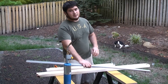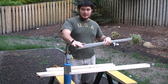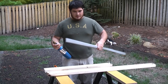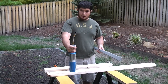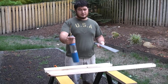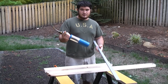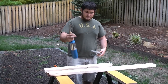Alright, so the first thing we're going to do is heat up the tip and then flatten it sideways. That's going to be done on the flattening jig like this — really simple. Now unlike the heat gun, it's kind of hard to just keep the torch on a flat surface and move the pipe fast enough to prevent burns. So we're basically just going to hold it in the air — the torch gives off enough heat that you don't really need the heating trough so much. So here we go.